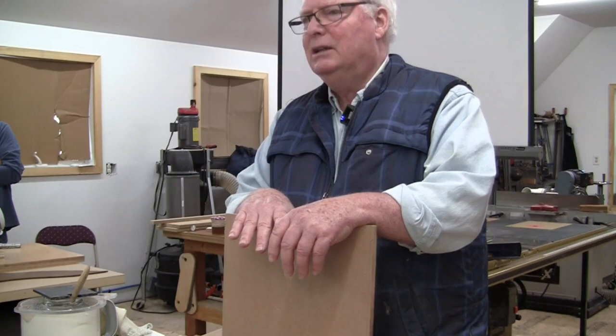I haven't had MDF curve, and I don't bother about drawer fronts. They're only like 4 inches high. I ask because I've never done veneering with MDF. Yeah, I treat it like anything else. The only difference with MDF is if I'm going to put edging on it, I will size the edges with hide glue and let it soak in, because as you know, MDF really can be very absorbent. And you can wind up getting swelled edges if you're not careful.